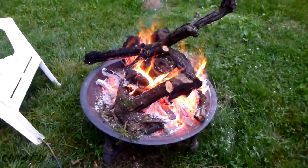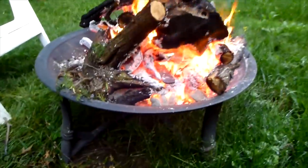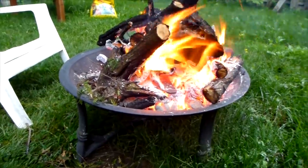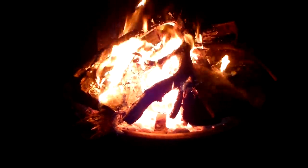Now let's get a hot fire going to heat treat the knife. You want something tall and relatively thick, because at the bottom you want as little oxygen as possible. If you starve a lot of the oxygen, you'll reduce the scaling on the blade. I waited until nighttime. This is my practice knife — the temperature is just right, you can see it's a nice cherry red. I have a heat gun, but you could use a blow dryer or a fan that blows right into there. It's very hot in there — you just push the knife into the coals. Make sure you have long pliers and a thick glove. Turn the heat gun on and it really gets the fire going.